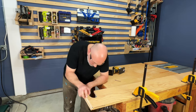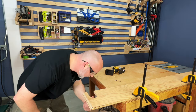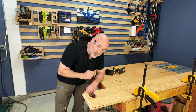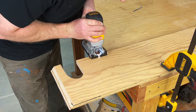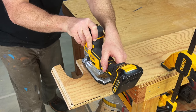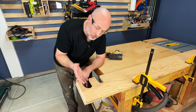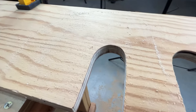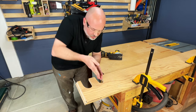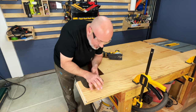That's not too bad — that's a pretty good curve and I don't see much blade deflection, maybe a little bit in this area where it slopes slightly. I'm going to put a scroll blade on and see what it can do. With the scroll blade it did really well — there is very little blade deflection. What I mean by blade deflection is as you're turning, the blade curves so you don't get that perfect 90-degree angle cut, just a slight bit.